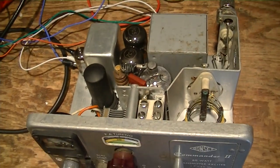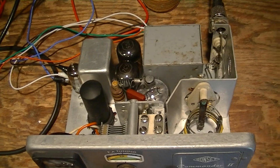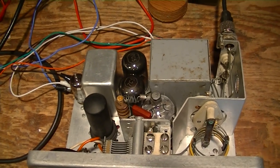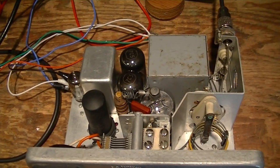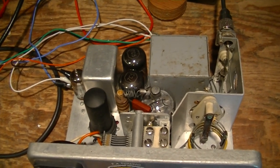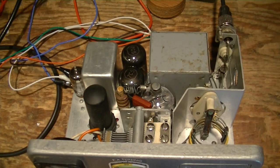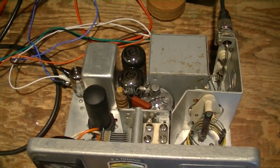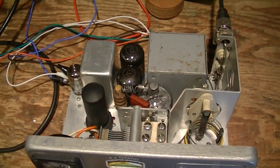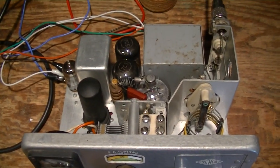This is a low-power AM transmitter. It can be run with a 300-volt vibrator power supply, a 450-volt dynamotor, or an AC supply — whatever you happen to have. It can have its filaments wired for either 6 or 12 volts; in this case they're wired for 12, and it's not hard to change. The connector on the back of the radio allows you to separate the low B-plus for the modulator and oscillator from the high B-plus for the final amplifier tube.